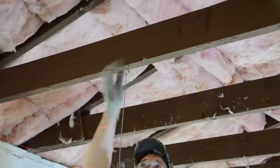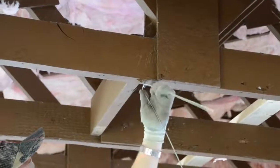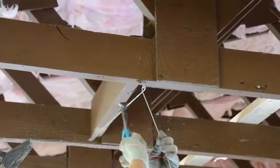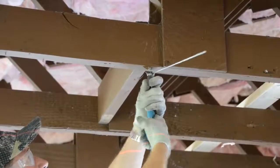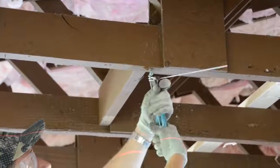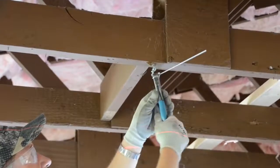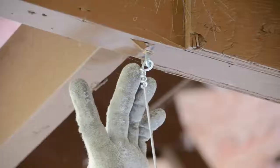Tying wires is easy, provided you leave a long tail that you can bend up into a handle for easy wrapping, 3 wraps in 3 inches. Use of wire cutters can also aid in tying as well as shown here. Again, you want to get at least 3 full wire wraps within 3 inches to meet code.